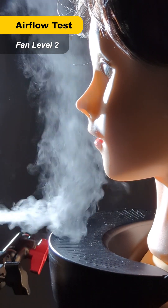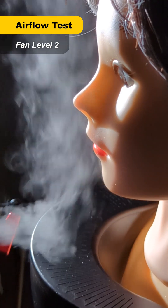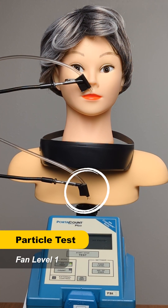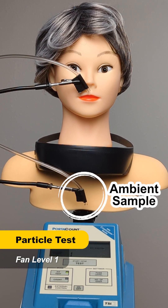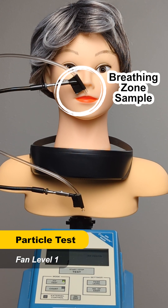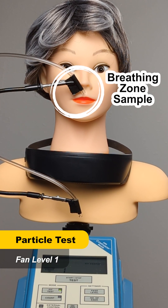But it's hard to tell because the higher speed dilutes the appearance of the nebulized water. So it'll take a particle counting fit testing machine to objectively show us how much unfiltered air is being mixed in. The testing machine uses a tube underneath the Respirate to sample the concentration of particles in the ambient air and another tube in the breathing zone to sample the concentration of particles in the output of the Respirate, including the unfiltered air that gets mixed in.